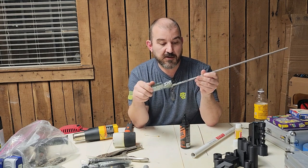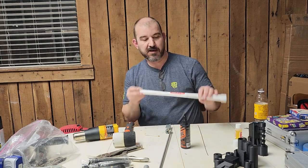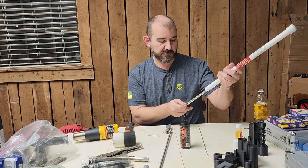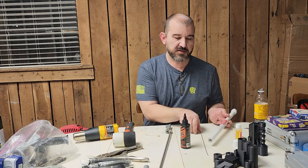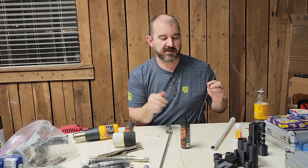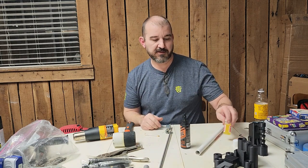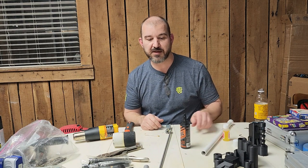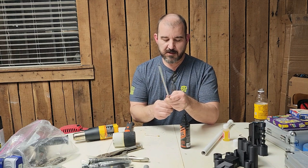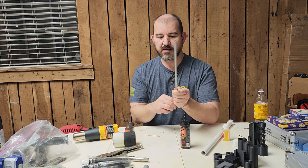Now, this does come at a cost. This kit from Muggy comes with about seven rods, and I barely used any of one rod sealing this barrel, so basically when you order this kit it'll be a lifetime supply — but it is a little pricey at $60. Your Luma Weld rods at Harbor Freight are only $10-$20, however the alloy requires a temperature so hot that you run a risk of damaging your valve body.